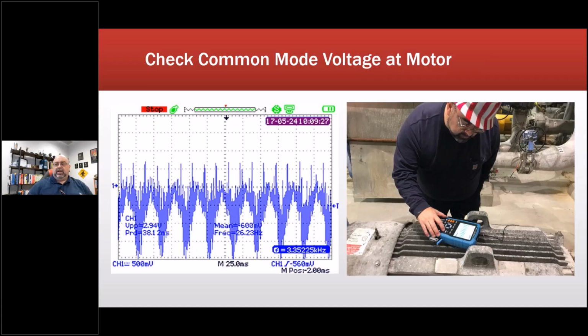And then we had to come up with some other stuff, which included a coiled filter on the ground going to the building in order to smooth out some of these current spikes that we were seeing. The actual surface of this machine, I wasn't too concerned about leaning on it. You will notice that whenever I'm doing anything around something that I suspect is an electrical hazard, I'm not leaning my other hand on there, and it's actually in my pocket so I can keep it away. But we'd already checked the voltage was not an issue there, and the grounding was good.